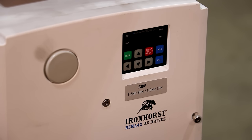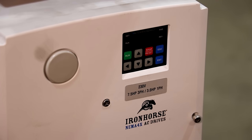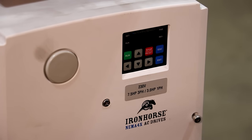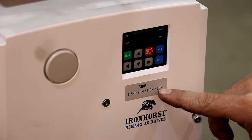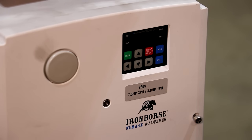In my situation I have a rotary phase converter, so I'm powering everything on three-phase. This particular VFD is sized for a 7.5 horsepower motor, which is what I'm running at three-phase. If I was doing single-phase input, it would only be rated for a 3 horsepower motor. This particular VFD was about $650 — fairly expensive — but I feel it's a better investment. As your motor horsepower gets bigger, VFDs quickly become more and more expensive. At some point, particularly running larger motors in a shop without three-phase power, it becomes cheaper to have a phase converter and feed these things three-phase power — you get smaller units, smaller wiring, and everything else rather than trying to use 220-volt single-phase input.